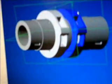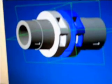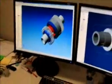That's all stationary. That all stays stationary with the actual outside stators. So all of that sits inside that tube, and these all stay stationary. And the liquid just flows in one and out the other. That stays static, and the outside housing here is the part that's spinning. We haven't got the gates being shown in here at the moment. They'll go in next, and they'll have seals on them as well, and that's what actually causes the fluid to flow around.